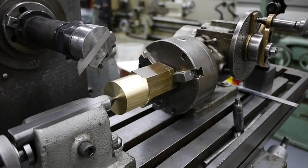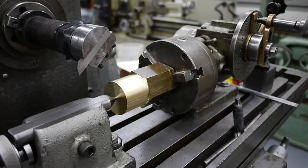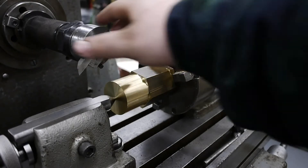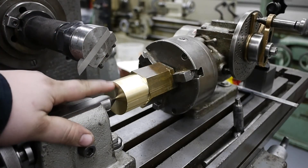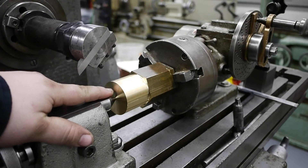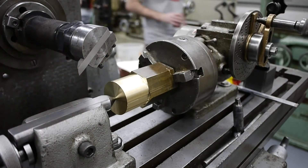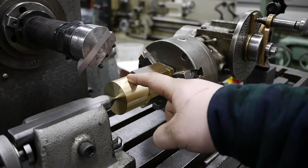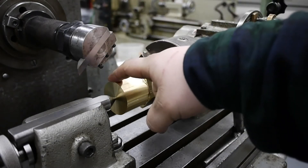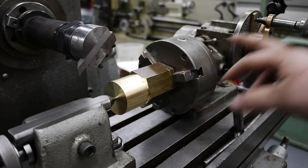Today we're making a two-inch diameter escapement. We have a hand-ground cutter in here with a radius, for the mechanical computer tic-tac-toe machine. I have this centered so the flat end of the escapement cutter is perpendicular with the center axis of the part. I have the Ellis dividing head set up at 40-to-1, and the tailstock piece of brass turned to size. Using SolidWorks, I calculated I need to cut to a depth of 172 thousandths and cut 36 escapement teeth.